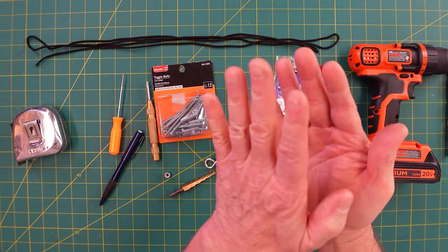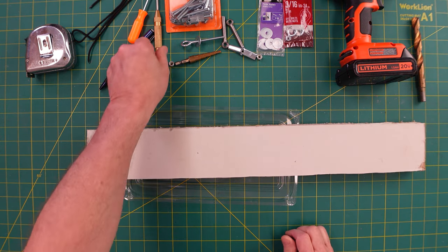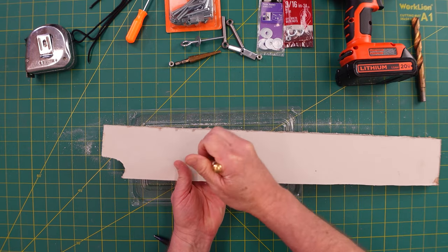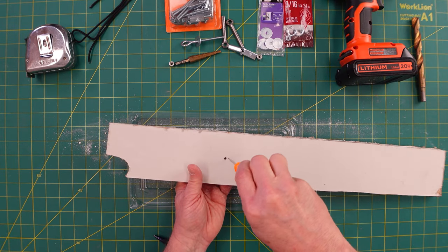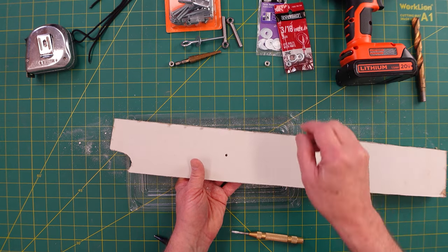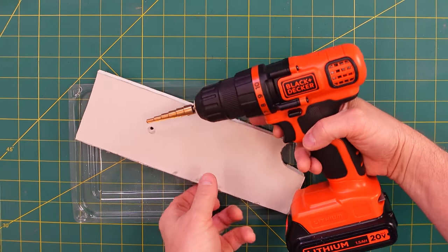I'm going to be up against the wall and it's dark, so I've decided to demonstrate what I'm doing on the wall here so you have a better understanding of what's going on. Mark the point, use a center punch and just punch down on it. Now this is drywall, and you can actually center punch yourself through the wall. If you go up against a stud, you wouldn't use this combination — just use a 3/16 inch eye bolt that screws into the wood. But we're going worst case here. Since we have a step drill, I'll show you what we do.